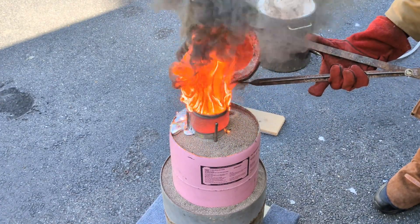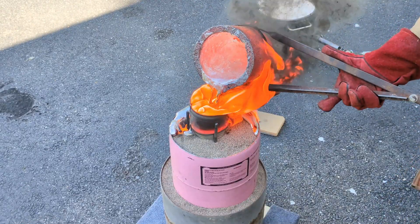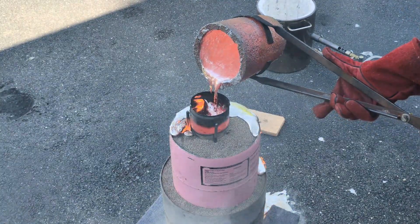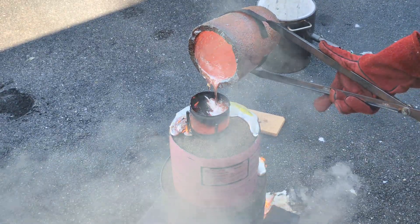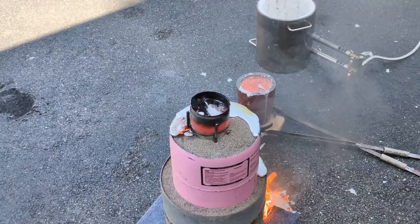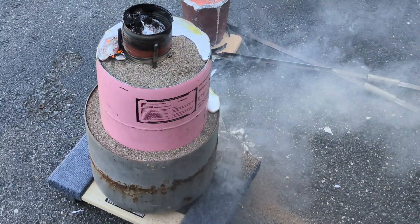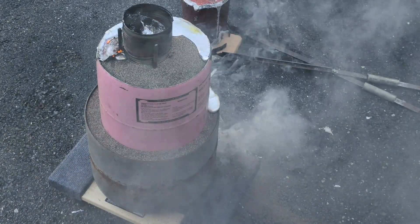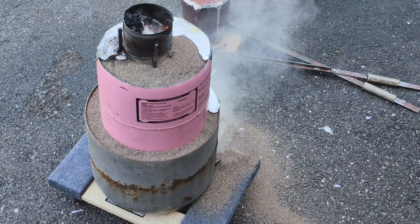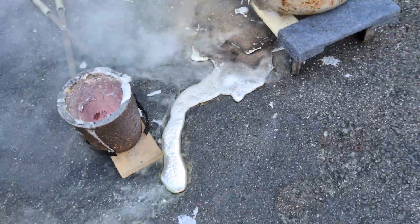As you can see there's a lot of black smoke — I think that's because I had about 2 inches of foam sticking out of the sand that had to burn away. Because of this I could not see, so I just kept pouring and pouring. You can see the aluminum is going all over the place and ruining my driveway — but this is not the first time. I'm going to throw some dry casting sand on top to try to get rid of the flame, because you definitely don't want to use water. I think from now on whenever I do lost foam casting I'm going to surround the mold with sand.